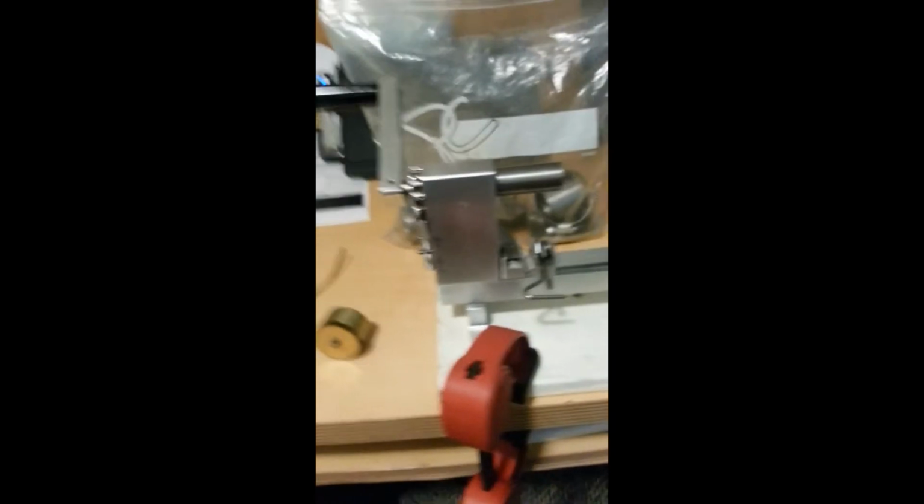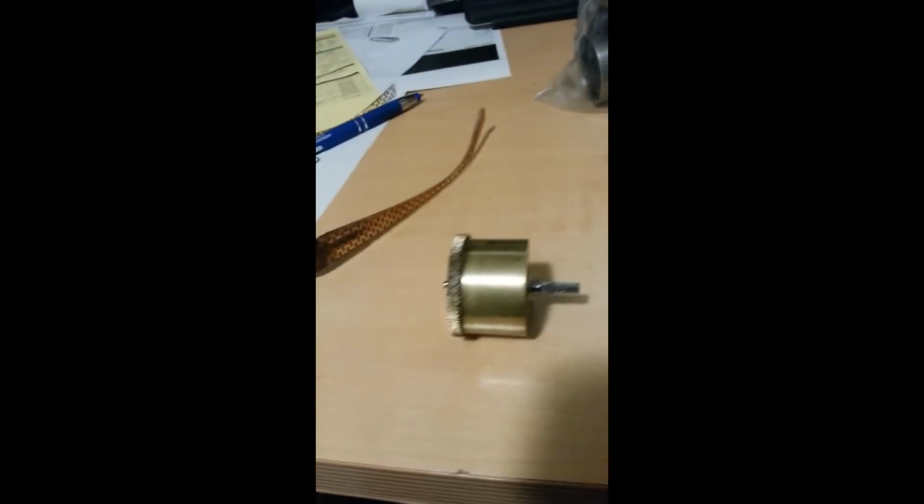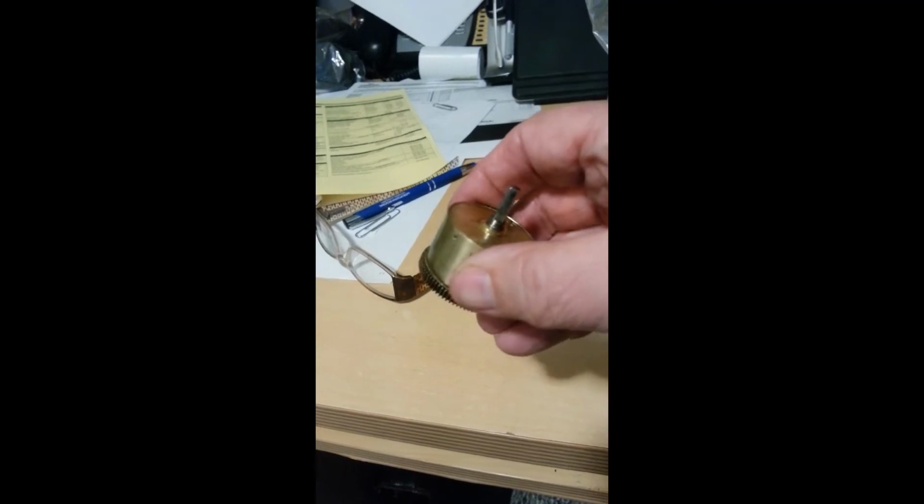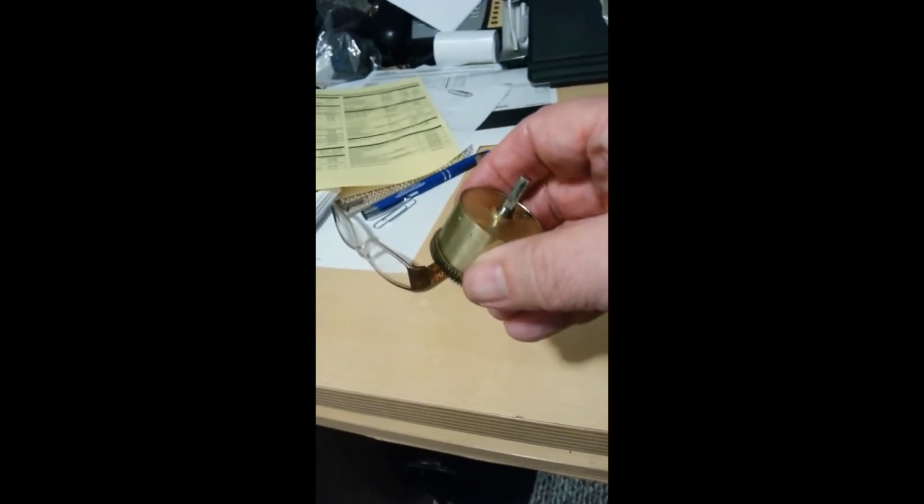So what I want to show you is the main spring winder I use. It's the Ole type, and I've got the main springs back in the barrels. So I just wanted to show you that that's the type I was using. The most important thing to remember on these is to grease the main springs before you put them in, and grease the inside of the barrel, and just squeeze the caps on gently and they'll go back into place. And to keep them separated one side from the other.